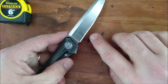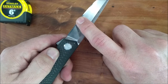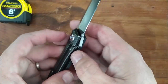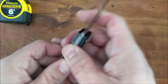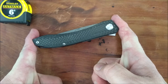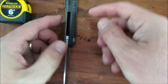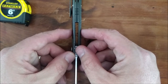The grind angle from the factory was 17.6 degrees on one side and 20.2 degrees on the other side — so that's very good. Since they're ground by hand, they never come out perfect, and that's not a bad grind angle. I've resharpened this to 18 degrees per side. The handle length is 12.71 centimeters, 5 inches. The grip area is 10.8 centimeters, 4.25 inches. The handle thickness, not counting the pocket clip, is 1.37 centimeters, that's 0.53 of an inch.